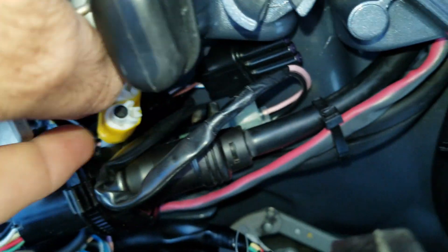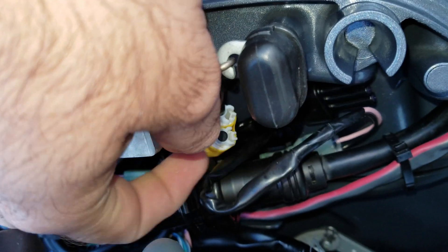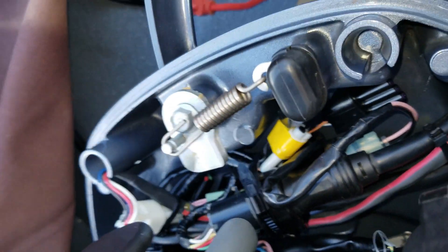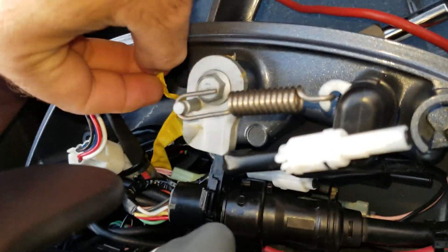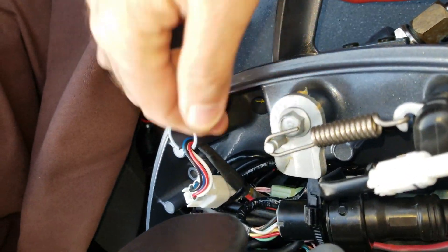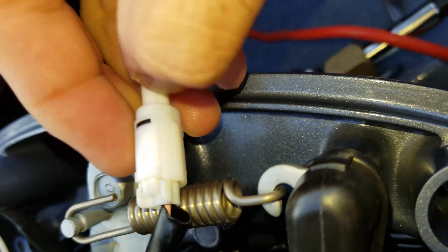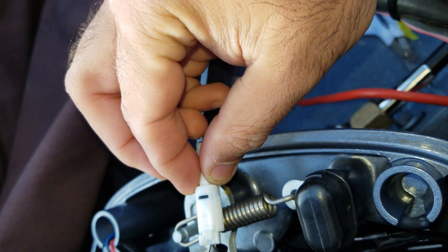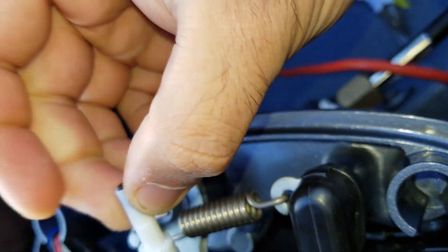Pull out the little yellow taped thing. We're going to attach this one to that one — fairly easy to do. Cut the yellow tape off completely. What I'm left with is these pink cables. What these do is allow resistance to be sent — instead of analog resistance for the trim, they will allow resistance to be sent to NMEA 2K so my chart plotter and gauge can read it.